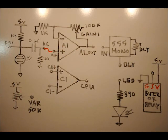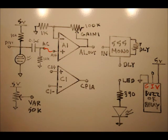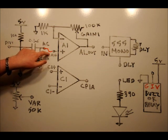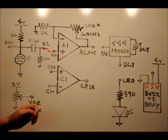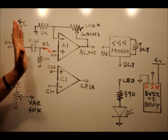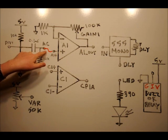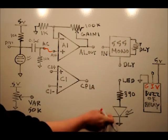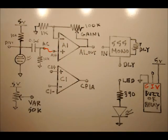That's our first of two onboard amplifiers. I've gone through the schematic and explanation of how a non-inverting operational amplifier works — check out the product videos below for more. Once we've connected those two lines together on the main pin block, we can adjust the gain using the 100K variable resistor to change sensitivity from very low to very high. We'll tune this resistor for very high sensitivity so it amplifies that tiny signal to a 5-volt spike whenever you cover the LDR. We'll use the LED pin to calibrate, connecting the A1 output pin to the LED.